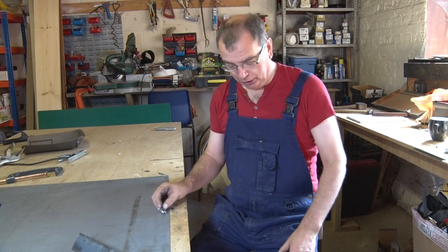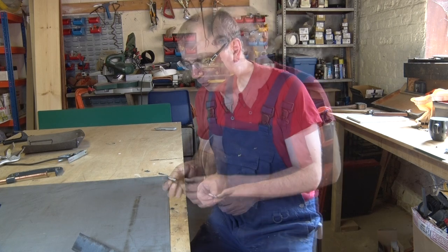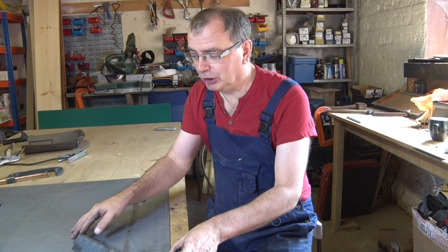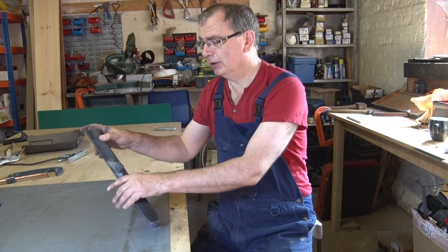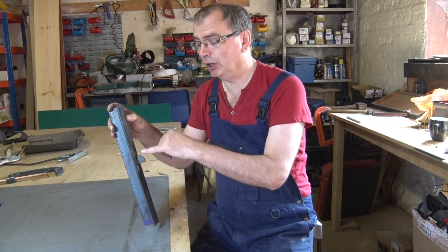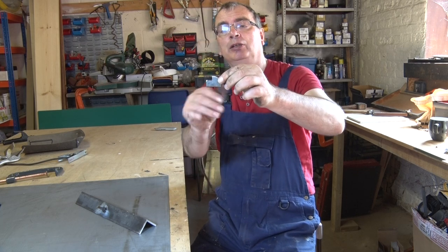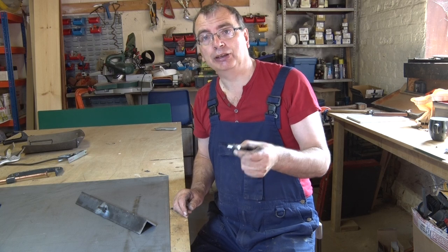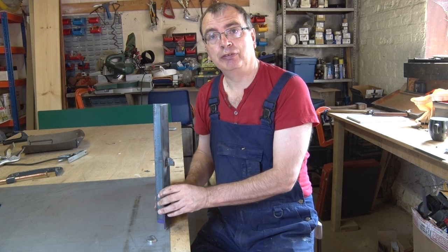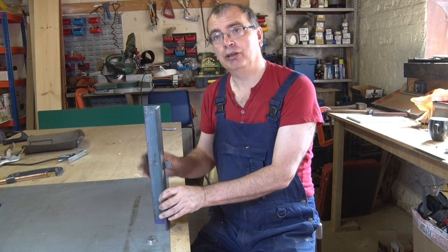Well here we are at the start of another new day with a lovely clean set of overalls — my wife has decided I can no longer be seen out in public with my concrete-stained ones. So today it's all the metal fabrication. I've cut some bits of steel, some more angle iron which are going to be the sides of the door frame for the oven. I've welded this little bit of steel on here — I've cut a little piece of steel, notched it out and put an end on it, and this is for the catch we're going to make. So I've quickly made a couple of these, I'll weld them into the edges of the various door frames, get them put into place on the oven, and then get some red oxide primer on that.